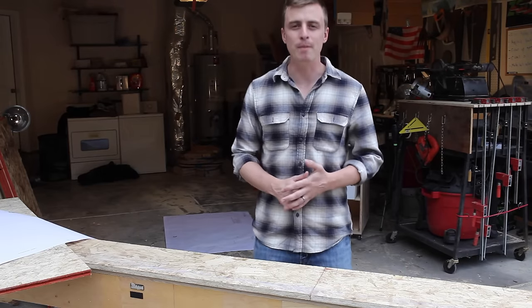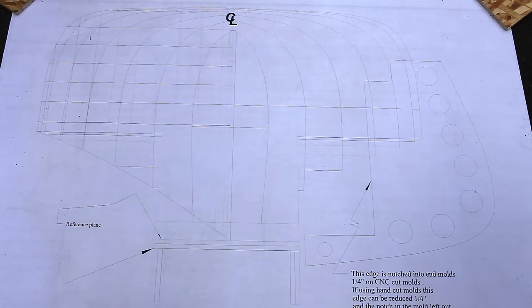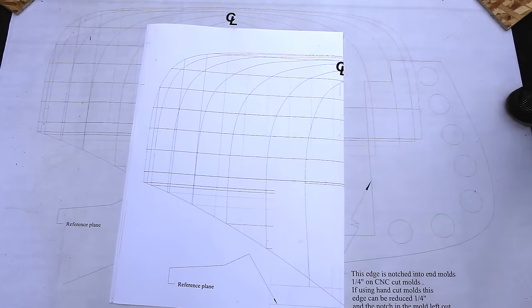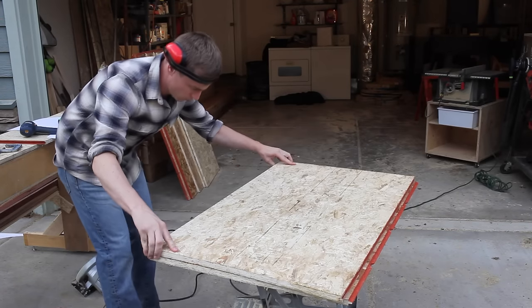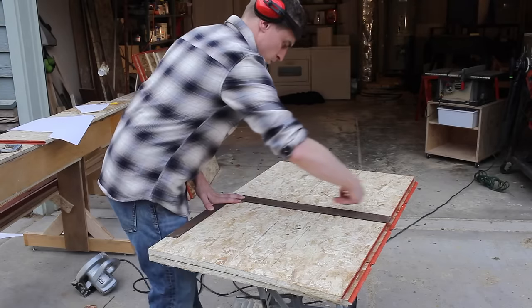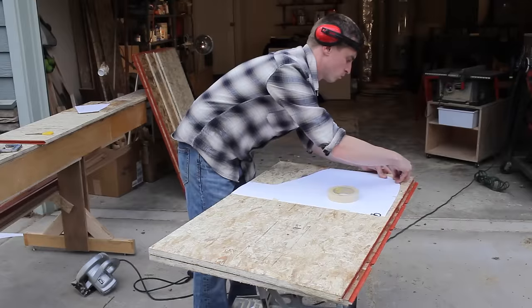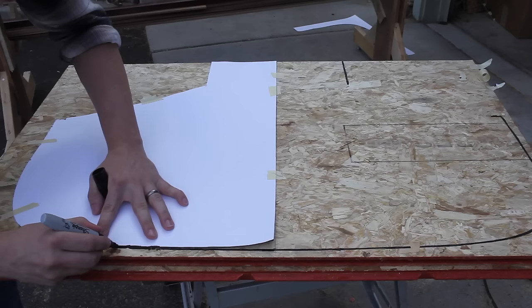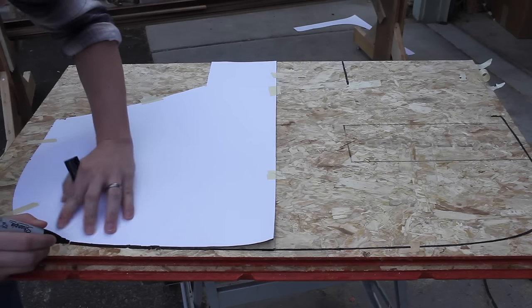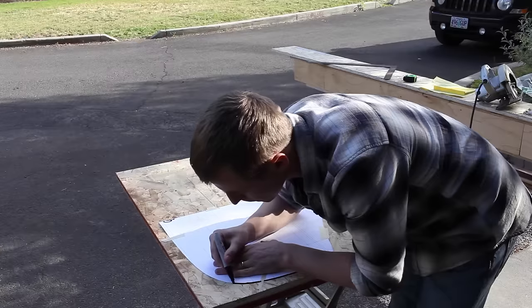I'm using the plans for a 15-foot Bob's Special. I ordered the plans from NoahsMarine.com. They sent me this paper with the full-size shapes of all the forms on it. I made a copy on thicker paper and then cut that in half to use as a template. You need two of each size mold, so I screw two pieces of plywood together, put a perpendicular line up the middle from the base, and then starting with the biggest one, I trace one half onto my plywood, flip it over, and trace the symmetrical other half. Then I trim my template to the next smallest mold and repeat this process till I have all my forms drawn out.